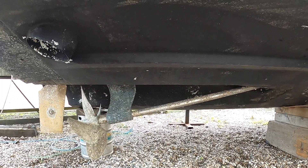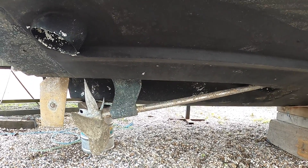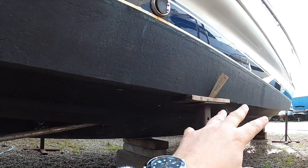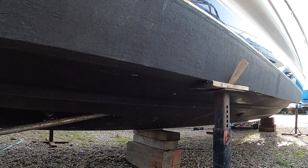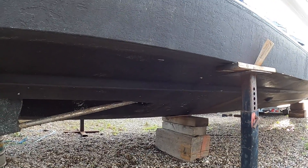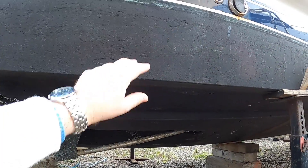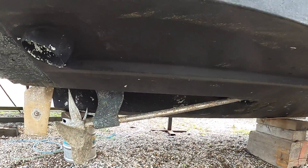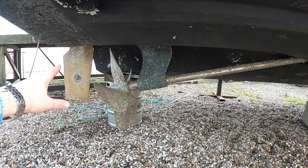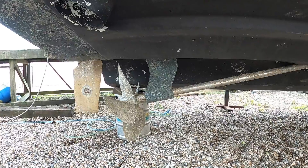It's a very serious system — it'll handle a lot of power and it works very well. Now the disadvantages: packaging is one, because if you have the shaft there then the engine invariably is up there, a long way forward in the boat, so it can encroach on the accommodation. There is a variation called V-drive which is exactly the same underneath the boat, however it goes through a V-box so the engine is above, putting the engines further back.